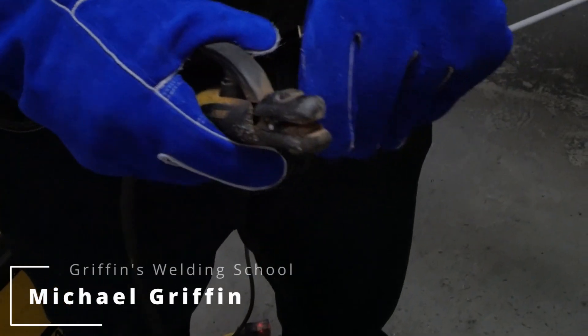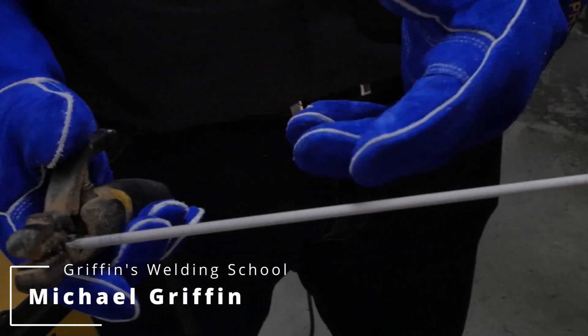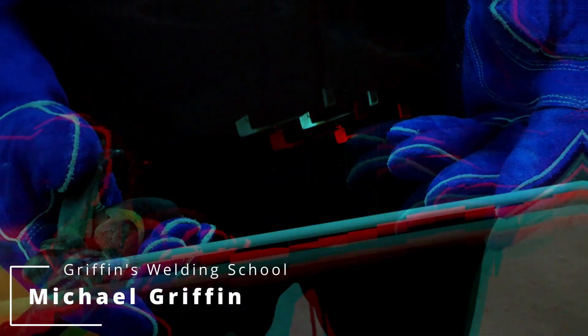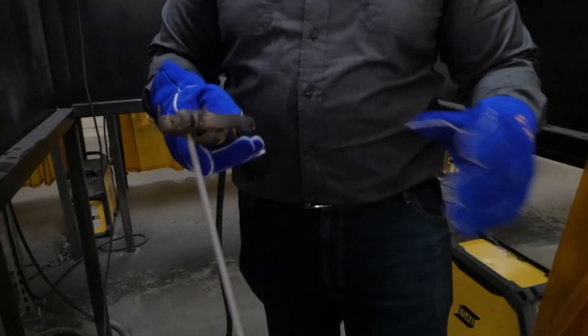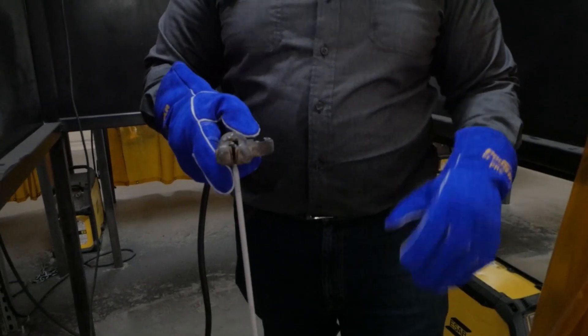You don't want to put it on the flux — this gray area is called flux. You want to put the metal part in there, otherwise it will not strike. So whenever you start doing stick welding, keep that in mind.